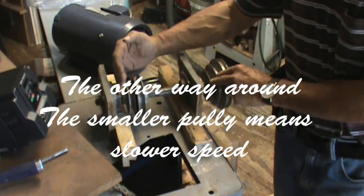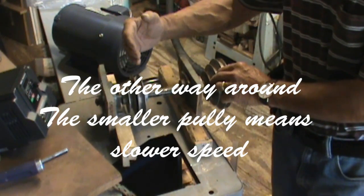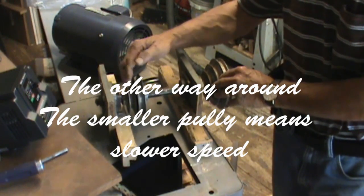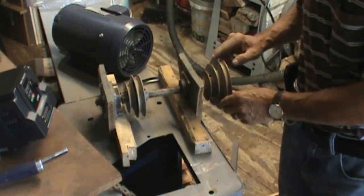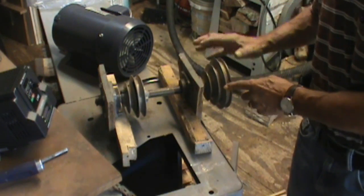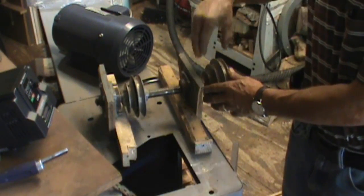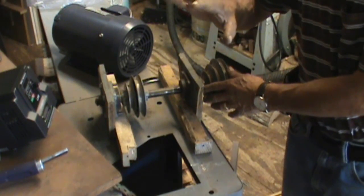as the motor pulley, and this one would be double the size. So that way, if you have a configuration where you're running on this one, it's a 1-to-1, and if you bring it up to this one, it reduces your speed to half of its motor speed. And of course on this end I had the original pulleys that went up to the lathe, the 4-step pulleys. So nothing changes on your headstock, nothing changes on your configuration of pulleys, of the original speed of the motor, if you have that option.